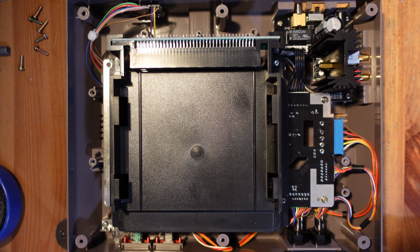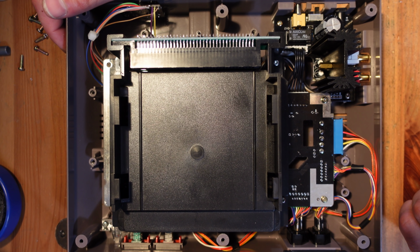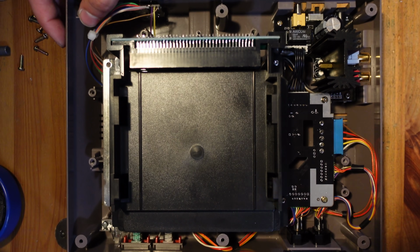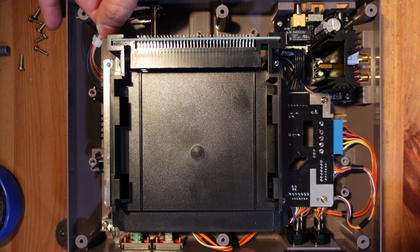All right, so now RGB is fully installed on the NESSity. Just briefly, I want to explain a few things that I did that I didn't discuss on camera yet. All of these wires here are video, 5 volts, and ground, and those all go to the usual places on the NESRGB, and I bundled them together with a little zip tie just to make it all organized.